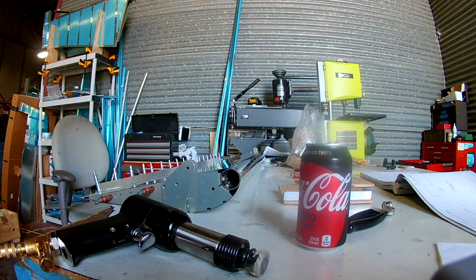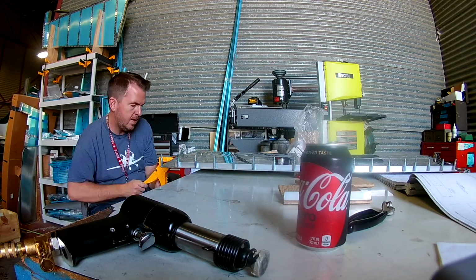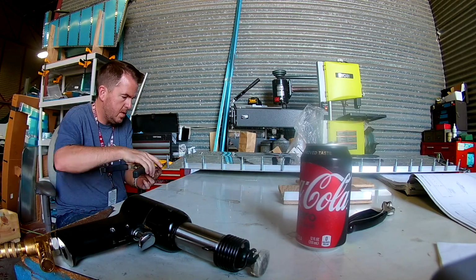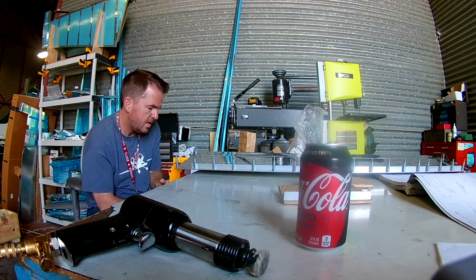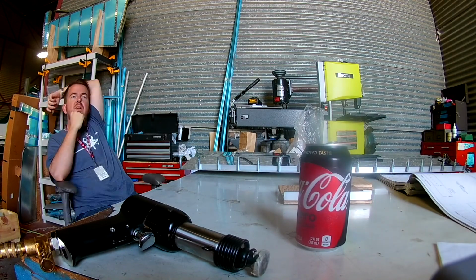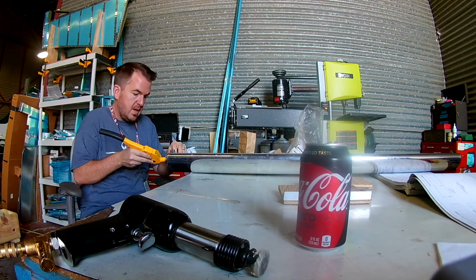So we continue with the finalization of the left aileron. After you rivet in the front skins and then the spars to the main ribs to the spar and then the back skins, then you pop rivet the two main ribs together.